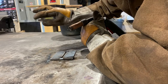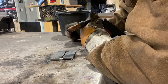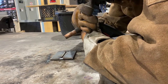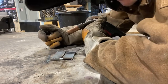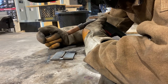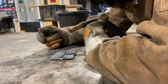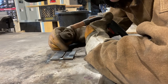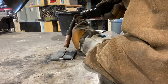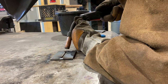We never want to have our pieces of metal side-by-side. If it's going to require a side-by-side piece of metal where I have no choice but to have them right up against each other and I can't have a gap, of course what I'd have to do is maybe create a groove. So in this case, just to make life simple for students learning MIG welding for the first time, have an eighth of an inch gap. Eighth of an inch gap is already applied. Watch the height between my nozzle and the piece of metal — half an inch.